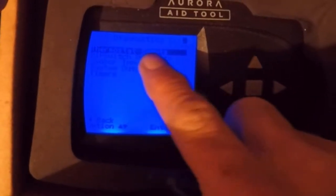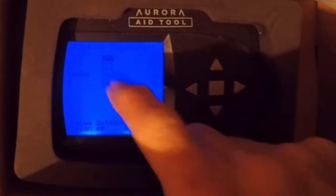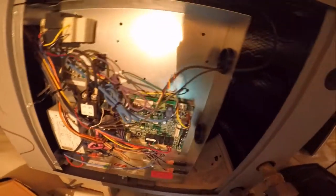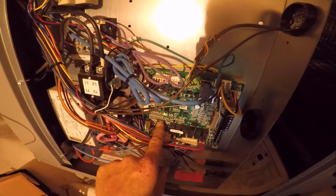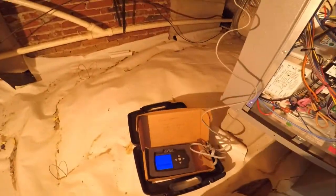Let's take this into high gear and check her performance. We'll go to diagnostics and thermostat inputs. Want to override thermostat? Yes — hit OK. Turn on Y1, turn on Y2, turn on G, and leave O off because we're doing heating. This is a fall PM — they want to check heating performance. You can hold the test button down until the green light shuts off, which puts it in test mode and speeds up the timers. She's kicking — we'll check it with our gauges.